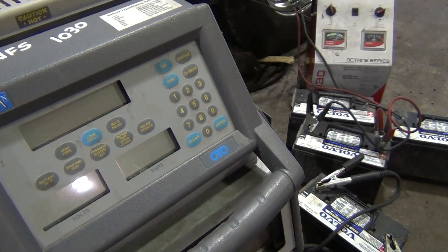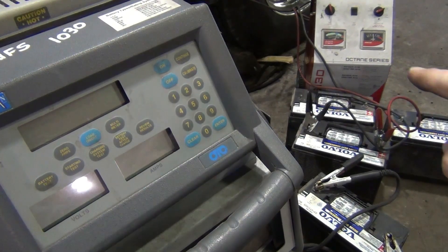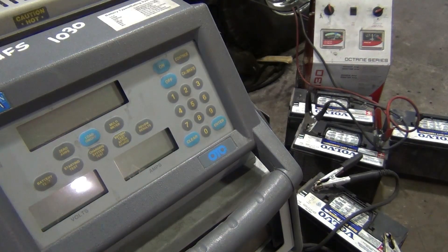Before we make a call to replace batteries, when they're in the truck and when we were first looking at this truck, we did a load test on them just to see how the batteries were performing, and I'm going to duplicate that test for you now. The first battery down here I had trickle charging at a couple amps overnight, and when I came back in, I found that the battery really wasn't taking a full charge — it was still trying to put a charge into it. I've got a second one hooked up on the charger in the back, and if you look at my gauge, I've got my charger set to 40 amps and that battery is still charging at 30, and it's been a couple of hours, so I think we found a really poor battery in the whole set.